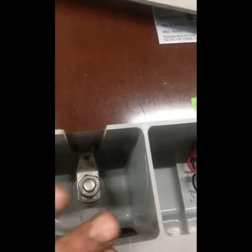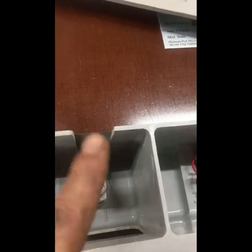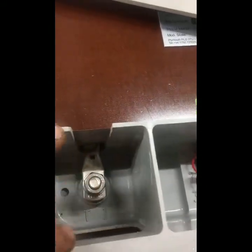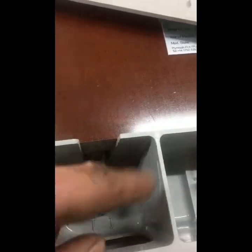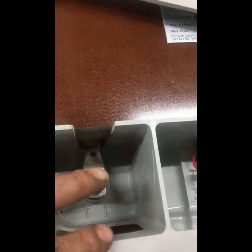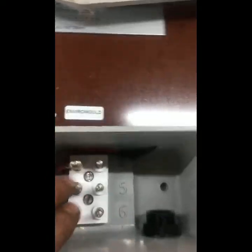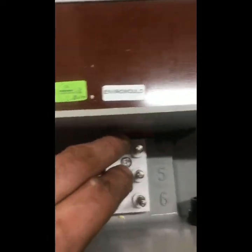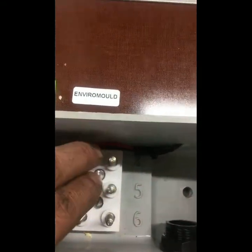The other thing about the leads is the leads are kept as close together and as straight from the rails as possible, because you don't want an imbalance in the leads of say a metre extra on one side, a metre less on the other, because that will affect the tuning zones, etc. of the operation of the system. We have some small tapping off settings inside there as well for the power supplies, so that's also part of the circuit.